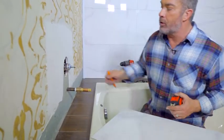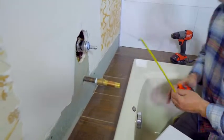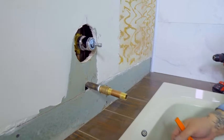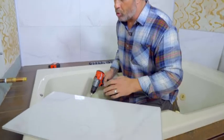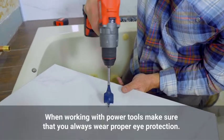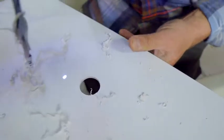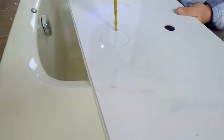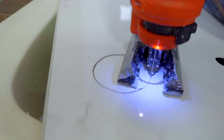We have some plumbing on this wall that we'll need to cut around. The easiest way is to measure off the wall to find the center of each mark — I've marked those here on the wall — and also measure up the height to the center of each hole. We transfer those measurements onto our tile and make the center marks for each hole. For the first hole, I'm going to use an inch-and-a-quarter drill bit for the faucet pipe. Always be sure to use eye protection when using any power tools. For the control valve hole, I'll start it with a drill bit and then cut it out with a jigsaw. I start the hole with a drill bit to allow the jigsaw blade inside, then cut the rest out with the jigsaw.